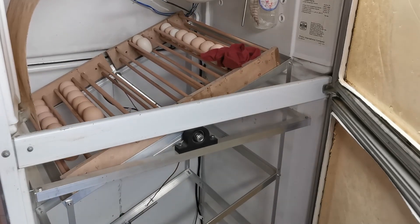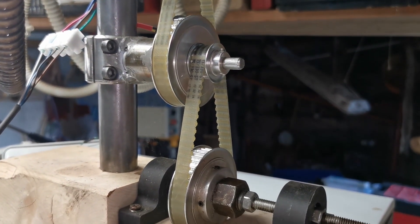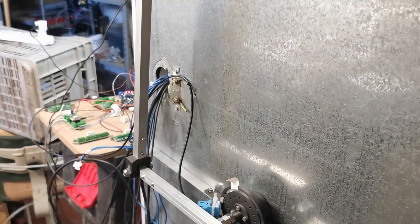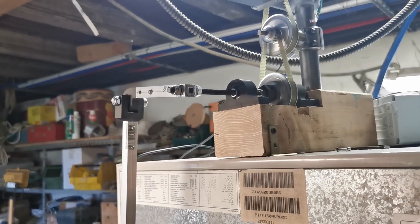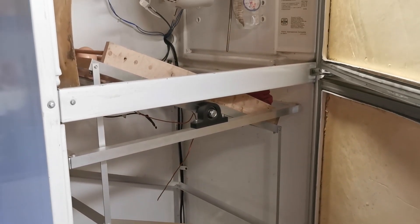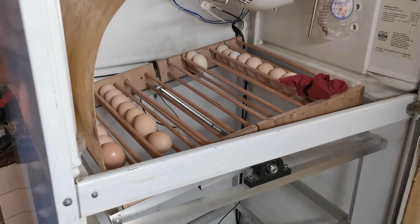As you can see, there is a stepper motor on the top of the incubator. In order to have a bit more torque, we have used a double reduction stage speed reducer with pulleys and timing belts. This gives motion to the main mechanism, which connects to the main shaft inside the room where there are three levels. Every level is able to host about 30 to 50 eggs. Remember to leave free space between them so the air can correctly recirculate and exchange heat with the eggs.